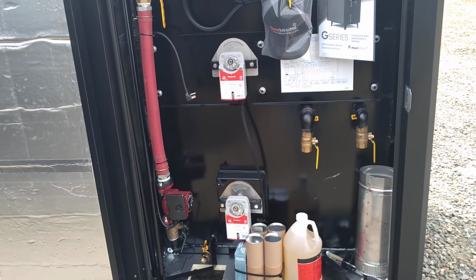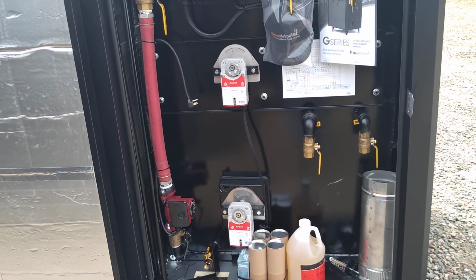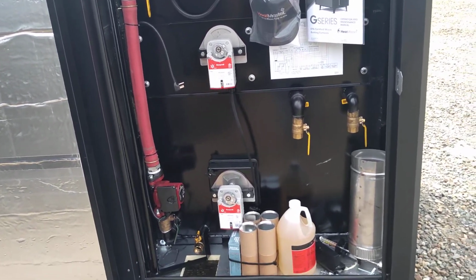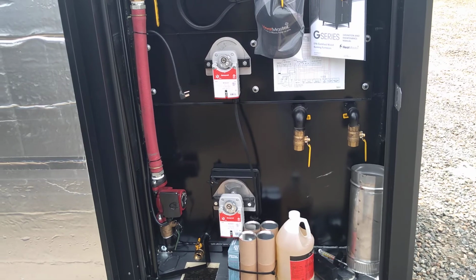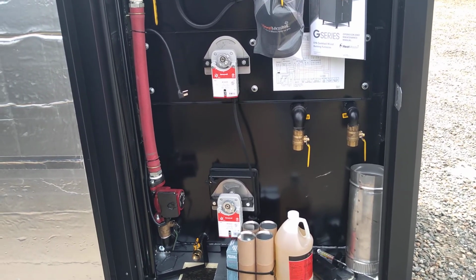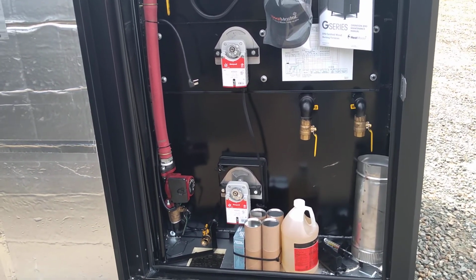So what this allows you to do is fine-tune the burn more precisely when you have soft woods, hardwoods, drier wood, wetter wood. My experience has been after burning several months that the old unit did quite well, but you needed more standardized, so to speak, wood. This one is more forgiving. The other thing with elevation differences can make somewhat of a difference too.